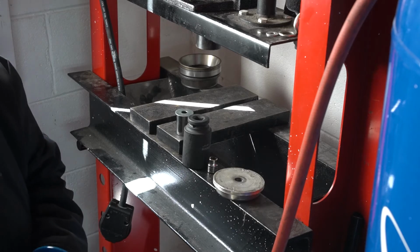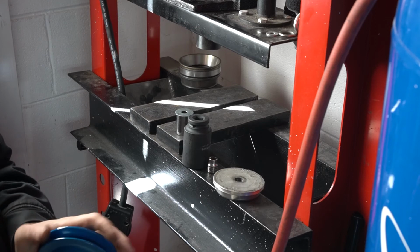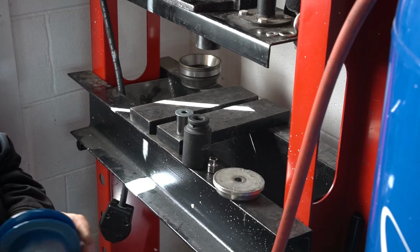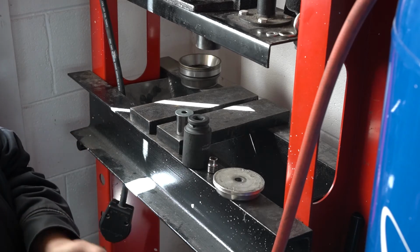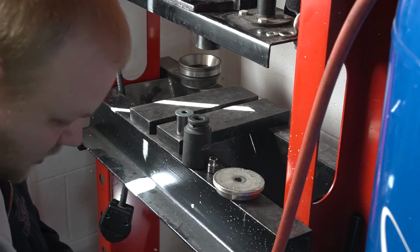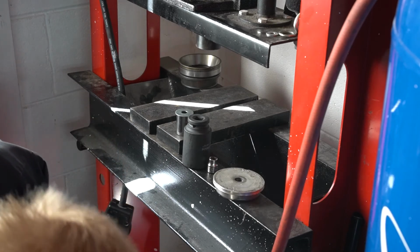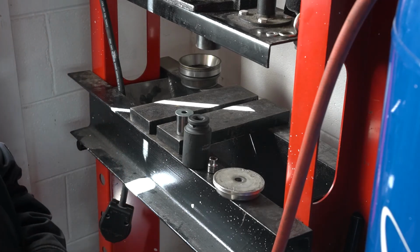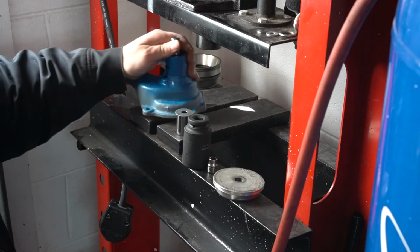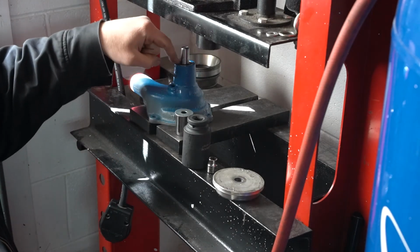Which, in my case, I have the engines out. So I'm going to press it down to about 1/8 of an inch, and then I can verify it with my crank pulley to see how far off I am. Hopefully not too far. And when I press this back on, if I was to just set the pump like this and press onto it, I'm going to push this shaft out.